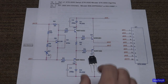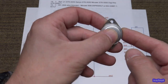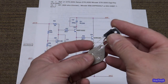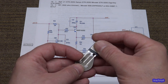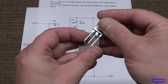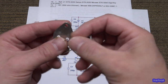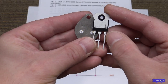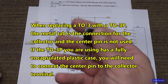Here's our first lesson. If you have a transistor like this — a TO-3 case — and you look at the TO-3P, they are lined up in the same manner. If I flip this over and bend these pins down, this is going to be the emitter, the middle pin is the collector, and this pin is the base. They are exactly spaced the same way. So if this were plugged into a socket on a heat sink, even the holes line up. If you line them up and bend right at the shoulder, it will be exactly the same dimensions, and you can find an equivalent transistor in this package that will replace this package.